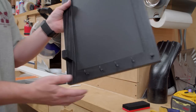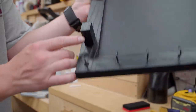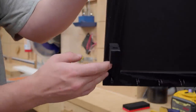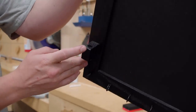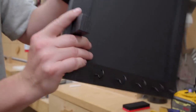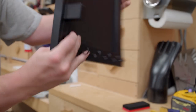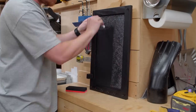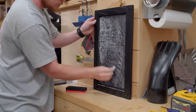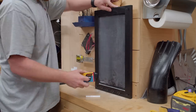The bottom of the block has a one eighth of an inch hole that will allow me to use a toothpick or something to remove a small broken chalk piece if it gets stuck, and the top of the block has a hole to allow the chalk to sit vertically. This should be plenty enough to keep the chalk in place while bouncing down the road. It's secured to the frame with a single screw to the back side. One final thing before installation is to prime the chalkboard — covering the entire chalkboard first prevents the first writing from ghosting or showing through after erasing.